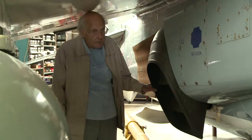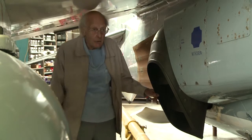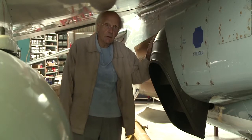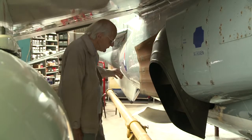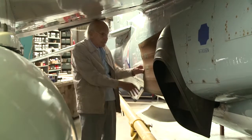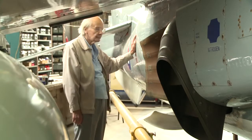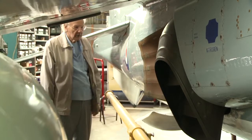We've moved back to the rear nozzle, very similar in principle to the cold nozzles — so-called cold nozzles, though they're really quite hot, about 100 degrees centigrade with the engine running flat out. But this rear nozzle is around 700 degrees, so I wouldn't want to be standing where I am if it were running. We have to protect the rest of the aeroplane from that heat. This gas deflector here is quilted so that it expands smoothly and is hinged to move accordingly, and the whole side of the rear fuselage is made of titanium because that resists heat much better than light alloys do.